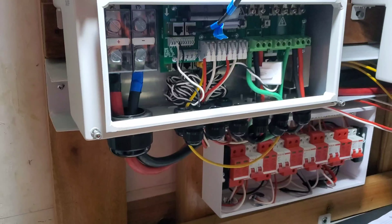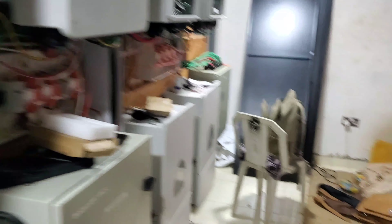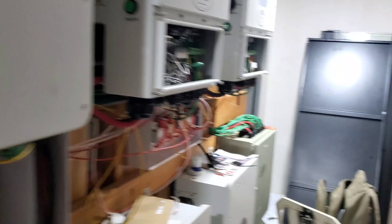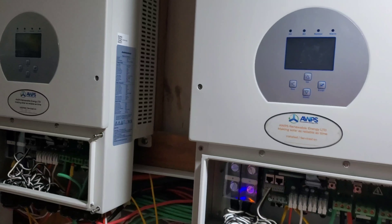So, we started to do our firmware update — actually let me take you back. When I did the last video everything was fine. Our panel lights were showing, all the inverters were talking to one another. Then we put the generator on and the inverters wouldn't see the generator. They saw the voltage, but they didn't see frequency, and I automatically assumed there would be a firmware issue.